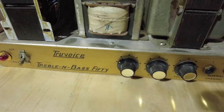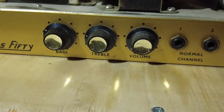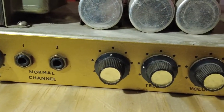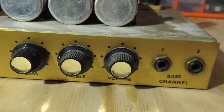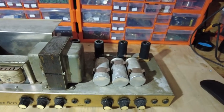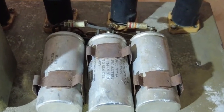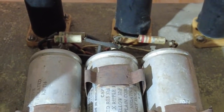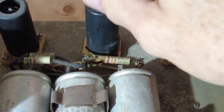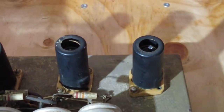It's a very simple amp — just volume, treble and bass on there. That's the normal channel, and then we've got volume, treble and bass — that says bass channel, but I think they're very similar. We've also got these electrolytics on the top here, and I'm never keen on seeing live wires just behind the live terminals, just behind the valves. People come in to change the valves and it's quite easy to touch those.